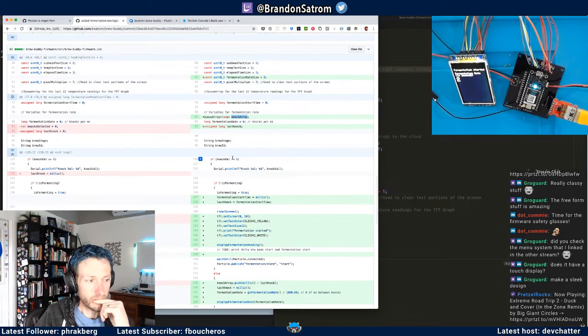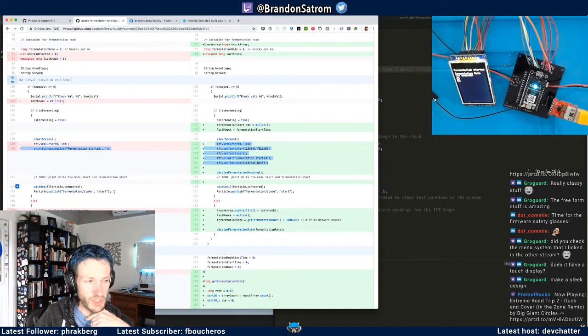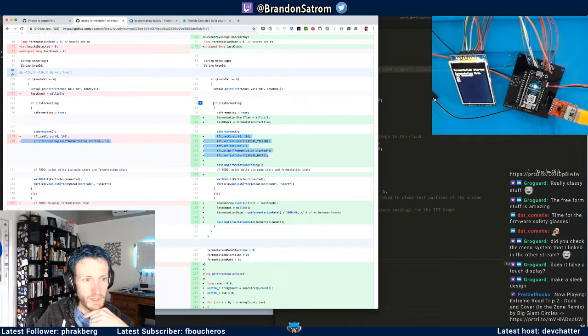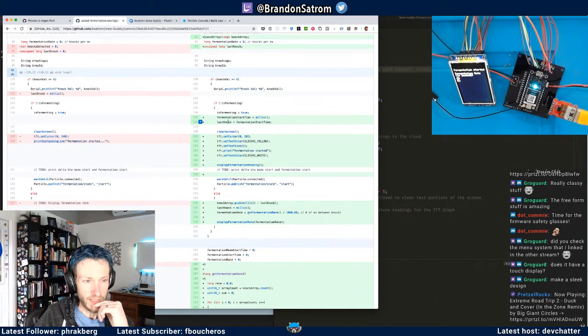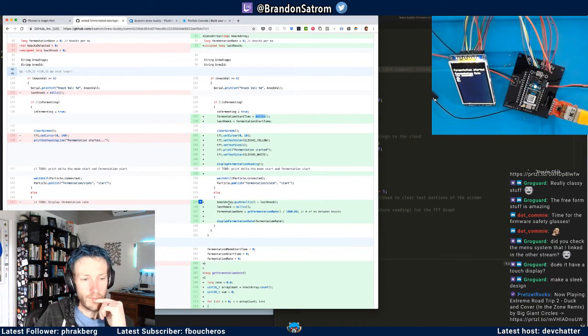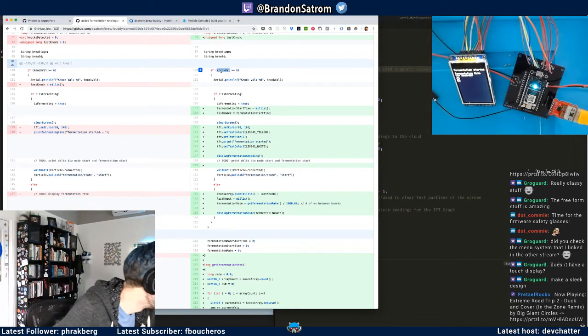And then from there, I changed up the screen a little bit to show when fermentation actually started. And then instead of publishing all of these to the device cloud, what I'm doing is calculating if fermentation has not started yet. I write all this to the screen and I publish a message to the cloud. And I also set the last knock value based on the current start time, right? And then the device comes out of sleep mode, so I wait until it's reconnected to the cloud and I send a message. And then if the fermentation variable has been set from false to true, and I catch a knock, right? This is in here every single time that the sensor is fiddled with.